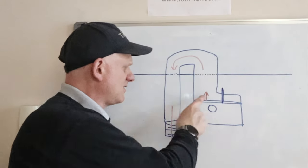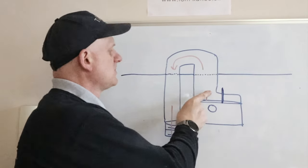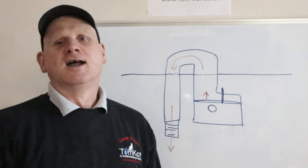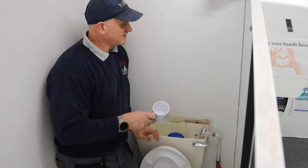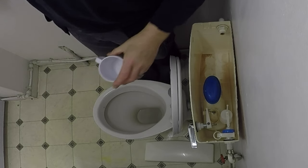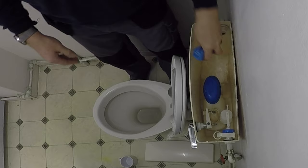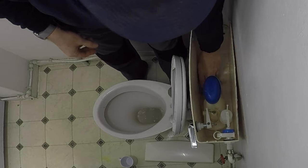If there's anything wrong with this diaphragm, it won't create the suction needed to force the water over the top to allow the weight of the water to empty the system. We've now gone as far as we can with the plastic cup, and we need to change to the dishcloth — it's just a matter of getting the cloth into the bottom and wringing it out.